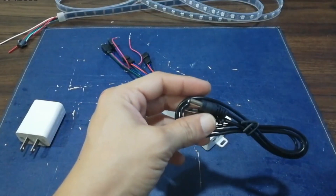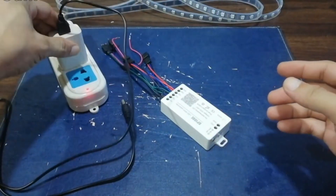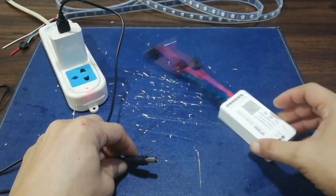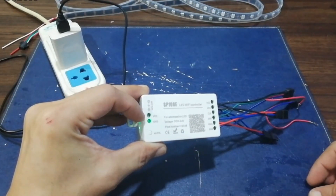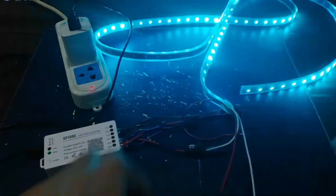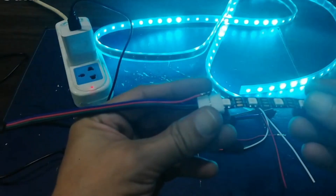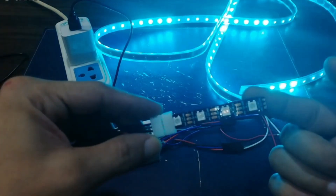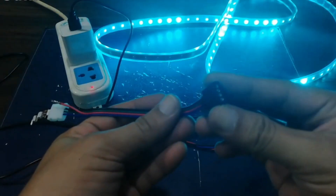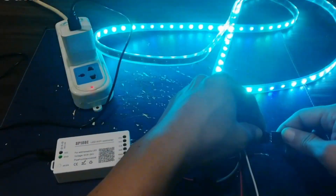Now let's power it on. I have plugged in the power jack and the phone charger in the other end on the controller itself. The controller will power on as soon as you see the green light on the controller. I'll be plugging in different strips with different ARGB connectors to test. The second strip I'll be plugging in is the one I created using a 4-pin connector. Since this is the only connector available, I have modified it to attach a 3-pin JST strip by removing or ignoring the 3rd pin from the voltage wire pin. Don't forget to block the 3rd pin we've ignored by using just a drop of super glue.